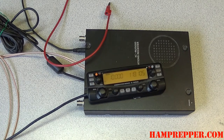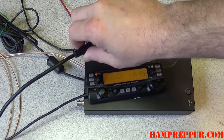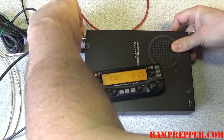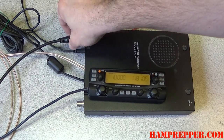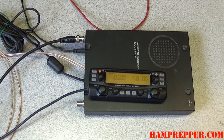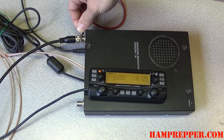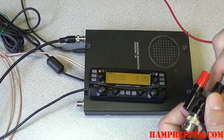I'm going to take my coax — this coax is outside, just laying around, coiled on things — and connect it to the antenna without switching the shield to the center. In this case, you can still hear WWV because it's quite a strong signal. But what's happening is the shield of the coax is doing exactly what it's meant to do — it's blocking that signal. The center pin of the coax right now is acting as your antenna; the shield is essentially floating or grounded. Most radios should operate in the grounded method.